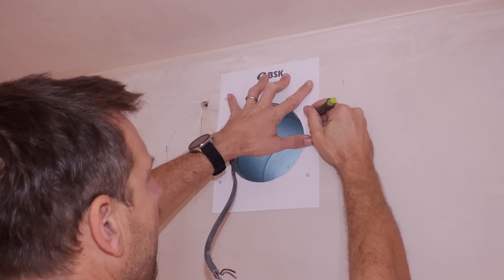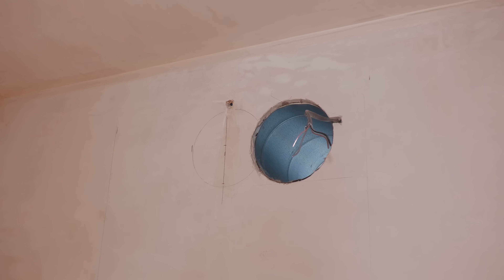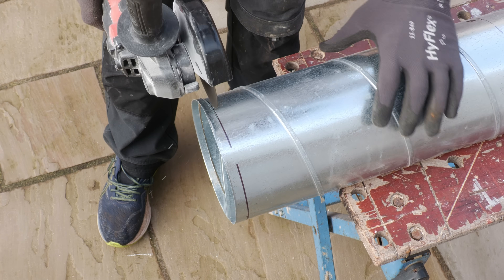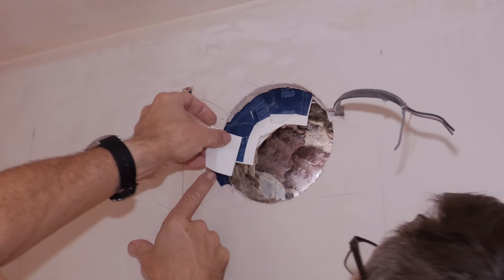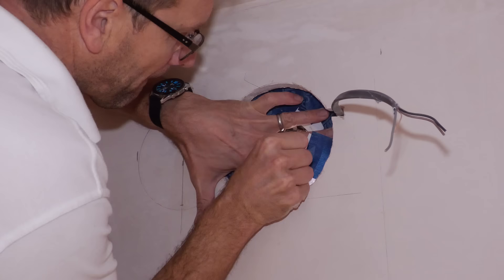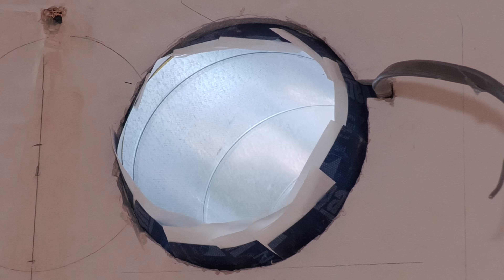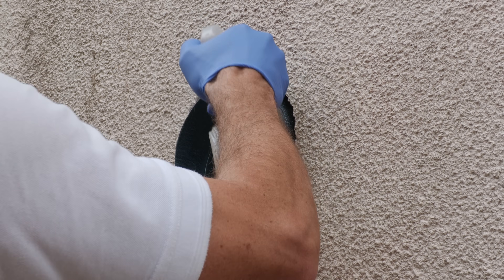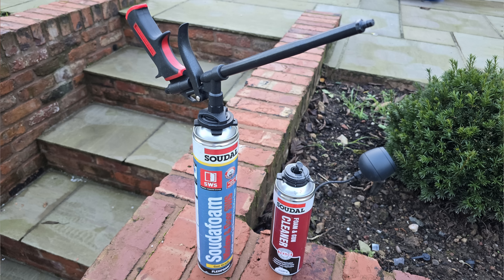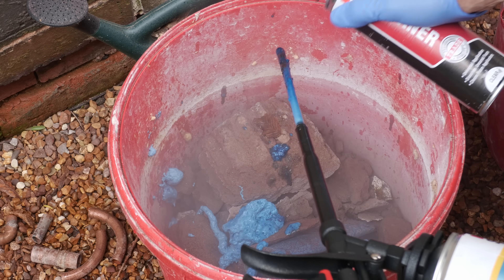I used a template in the instruction manual to pinpoint the entry point for the electrics, cut out a notch, and then did a bit of fine tuning around that hole to make it absolutely perfect for the duct. I marked the 10mm overhang, trimmed the ducts down to size with my grinder, and sanded off the rough edges with my Dremel. I was anxious the new pipework didn't compromise the vapour barrier, so I used some tape left over from the insulation work around the edge of the hole. By moving the backing paper up a bit I could stick it around the membrane, then push the duct through the hole and peel off the backing paper, sticking the duct comprehensively to the membrane — and it worked brilliantly.